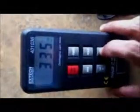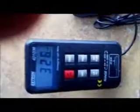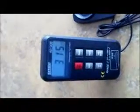Finally, there's a record or erase button that when you hold and keep pressed, starts recording the measurements, and it keeps recording until you want it to stop. The way you stop it is you just hit it once, and that ends it. The recorded part is stored in the data logger, and there's a CD that you get. You can install it on your PC and connect the data logger with this cable to the outlet over here, get that information onto the software, and analyze it on your computer.